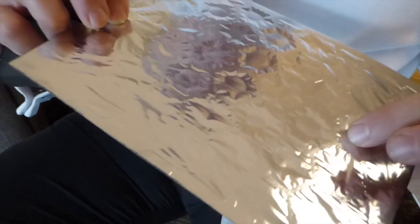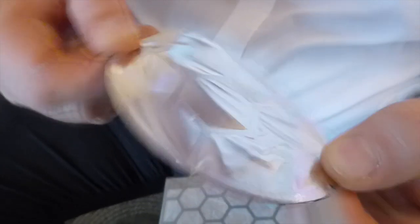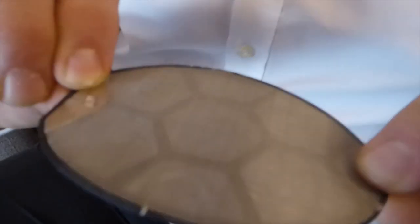It's probably around about a quarter of the cost of a decent planar magnetic driver. And we actually have some driver material here — can you tell me something about this material? Yeah, so this is the actual core material that we've been developing for about the last five years. It's got a metalized polypropylene membrane, a form-X spacer, and then a mesh on the back as the ground plane. And you can see that it's formed here into the drive unit, which is actually what's in the headphones.